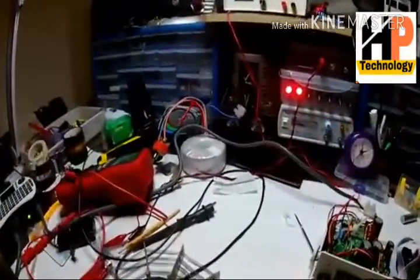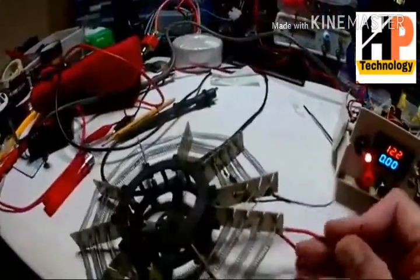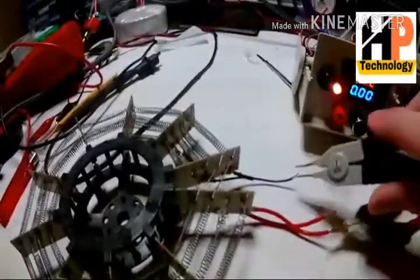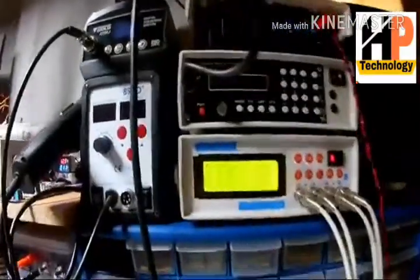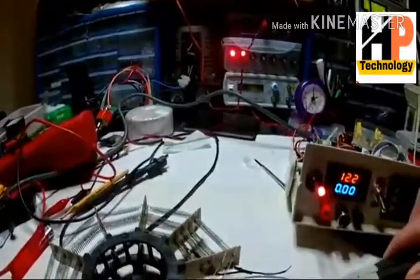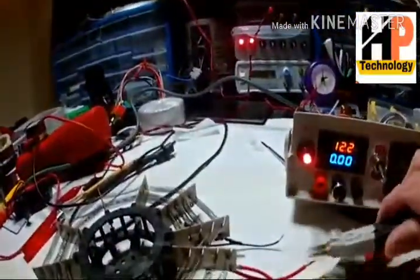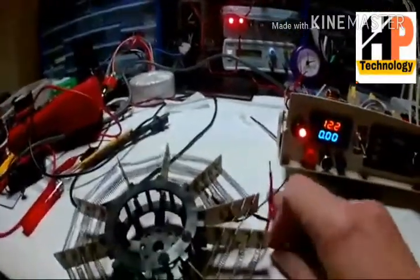Really, I've got it on capacitance. I don't want it on capacitance, I want it on resistance. Let's just click on there. I think that's 50. Is it 50 ohms? There we go, we've got 52.84. And then between here and here should be about half of that. Oh, double it. Okay, so the smallest one we've got is 50 ohms, or we've got 100 ohms as a big resistance, right?